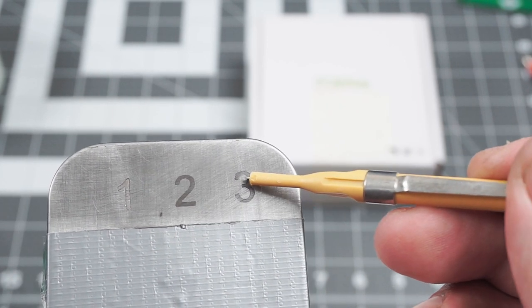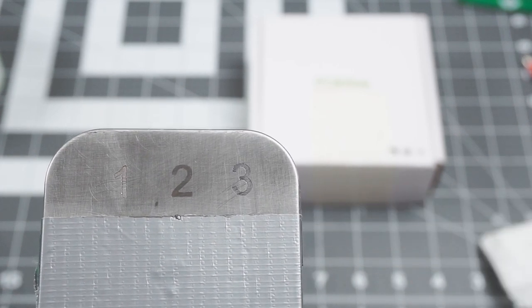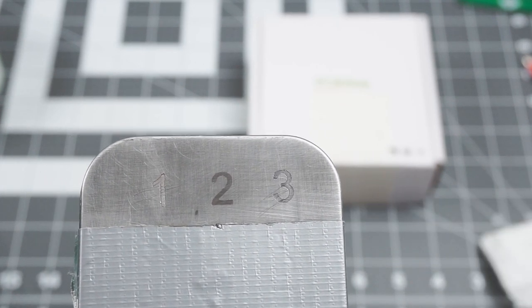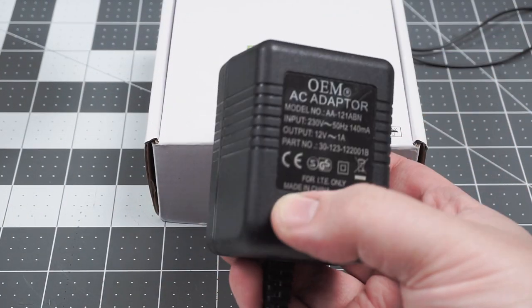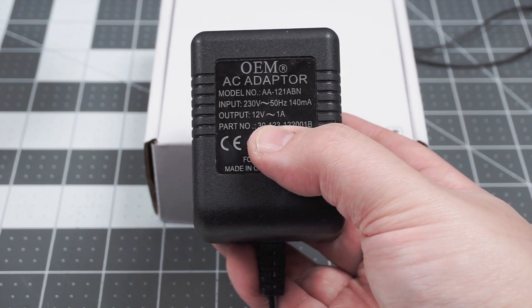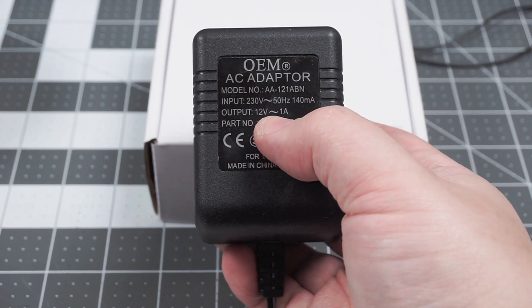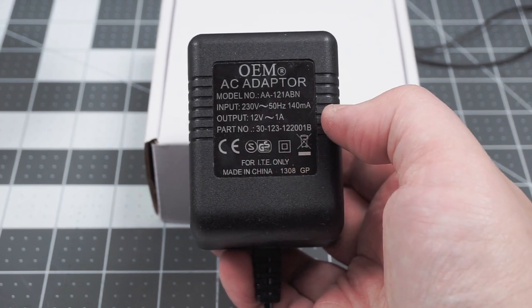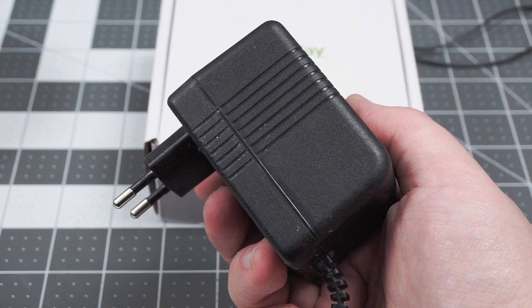Now that we have established a need for the power supply with both DC and AC outputs, we need to figure out how such a device can be made. First component is a wall-wart with around 12 volts and 1 to 2 amp AC output. AC output is often indicated by this squiggly line or the letters AC. A simple old-style transformer-based wall-wart is all we need for the AC-based marking process.